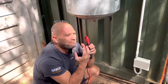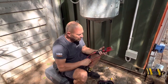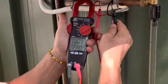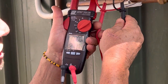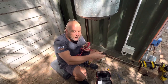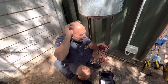I want you to think of amps as flow rate. This device now becomes like a water meter — it's not a pressure gauge, because the voltmeter is your pressure gauge. Think of volts as pressure. We put the volts on and we're getting 214 volts, so it's six volts under what it should be. But when I put the clamp around a cable, this thing starts measuring the flow of electricity — or amps, named after the French physicist Ampere.